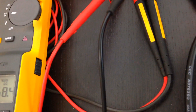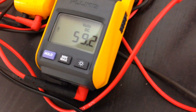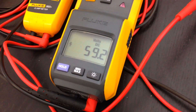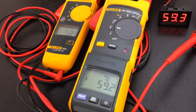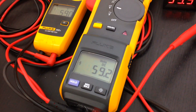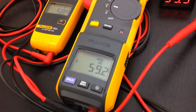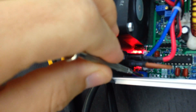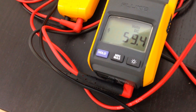So I'm going to do a quick demonstration. Turn this thing on — 59-something volts. The reason I'm setting it a bit higher is because as soon as you turn it off, the battery drops a little bit. Normally it drops between 0.4 and 0.5 volts, and in some cases with some batteries it could drop up to 0.7 volts. So just go down and turn like this — as you turn, you see the voltage increasing and dropping.